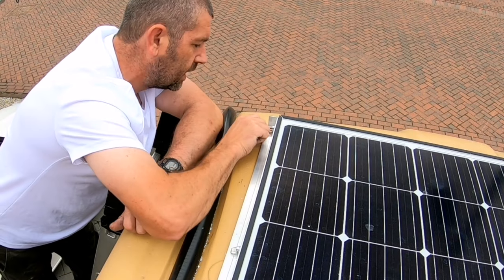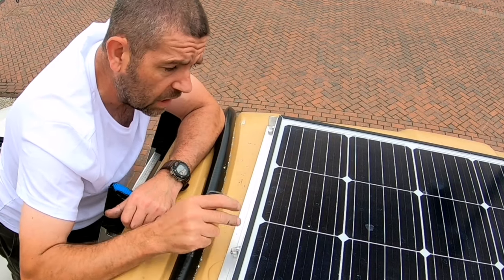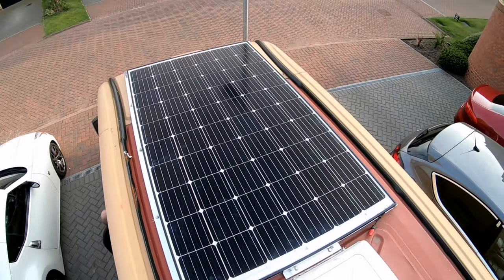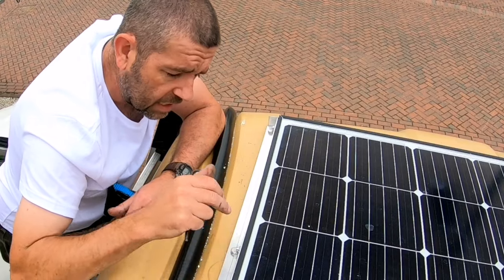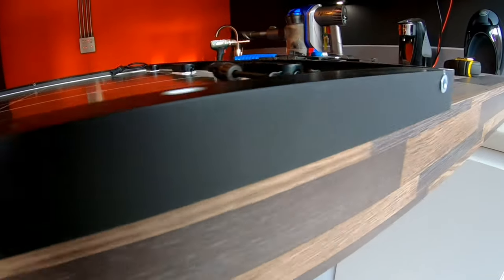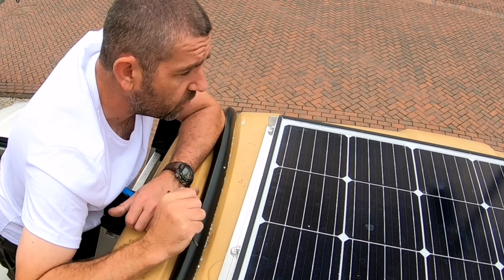Here's Spunky going around the perimeter edge of the solar panel making sure the 6mm bolts that hold it onto the framework are tight. There are 15 bolts that hold the framework onto the roof itself and 16 bolts that hold the solar panel up to the framework — so that's 31 bolts. Why I didn't use 32, don't ask, but it's not going to go anywhere.